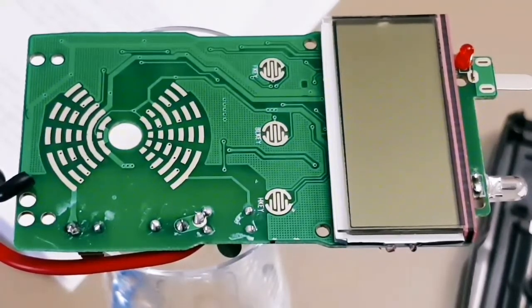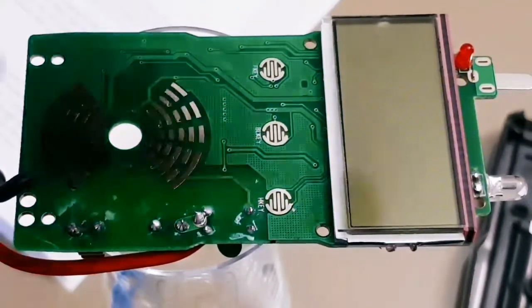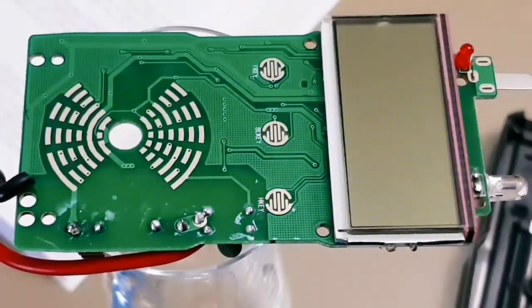We have the non-contact voltage detection unit right there. So what that does is when you're coming close to power, it generates the signal and passes it through, and you get this nice bright visual and audio LED indicator going off saying that indeed it's live power.